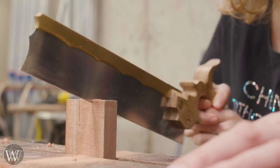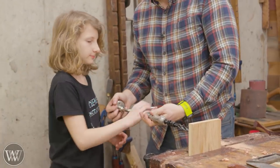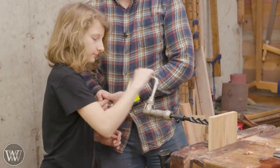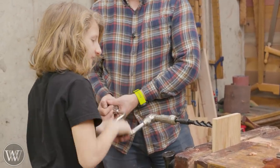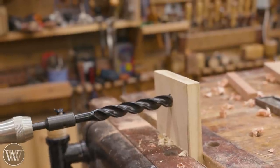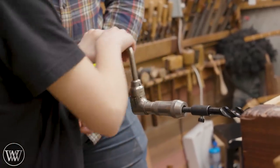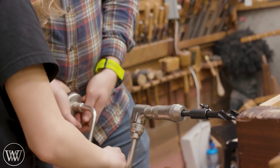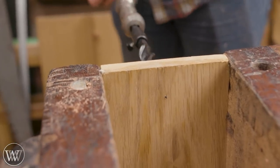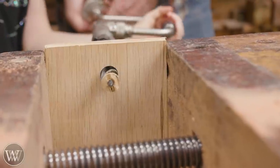Look at your reflection. I will hold it and you drill it. Other way — there you go. You drill it. Keep going. Stop — back up. See that crack on there? We don't want that crack. So to fix that crack, we're going to change things around. Crank it. Stop — look over here, the bit is sticking out. Now what we can do is stop it and turn it around and drill from the other side. There we go — we got a hole.